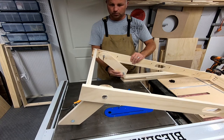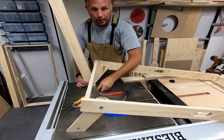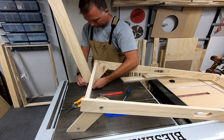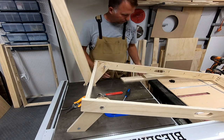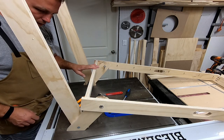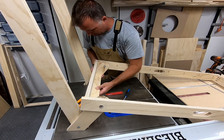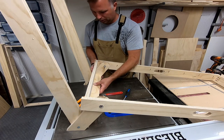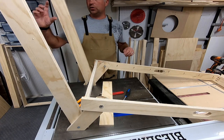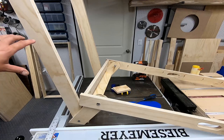I use stainless hardware on this — carriage bolts — because it's going to be outside. Those two legs now fold in just like a normal cornhole board. The cup holder arm pieces go on with wing nuts — I'm using jig nuts from Rockler that I had laying around; they work perfectly for this application. Tighten those down. Now I just need to put the top on — Kreg jig from underneath — and I'm adding a support piece at 20 inches that goes right in here. That gives the leg support and also acts as a stopper for the legs.